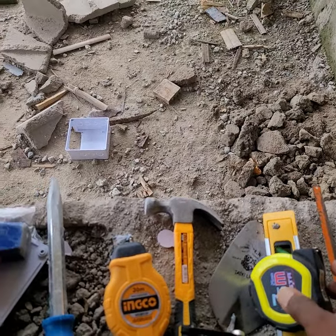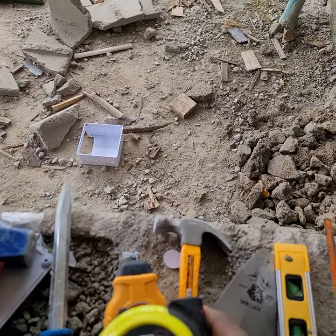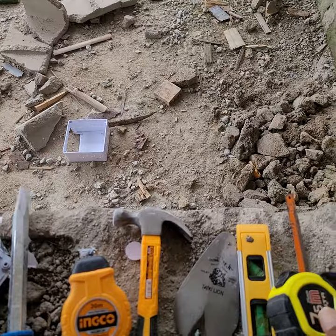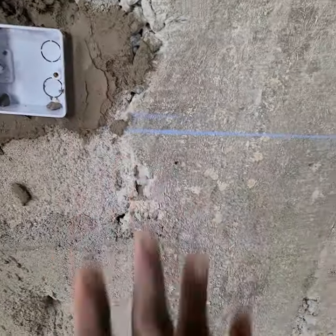Before then, when taking level, you have to make use of either the water level or the chalk line. You have to make use of a measuring tape. The level you want — if you want your line to be on this level, like I'm taking 135 now for my switch level. So if you want to do that, the first thing you'll do is take a measuring tape and measure the height of the place.